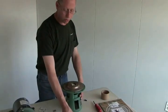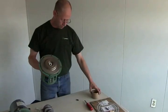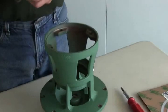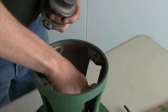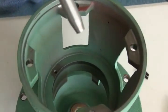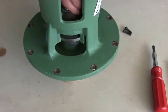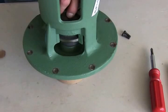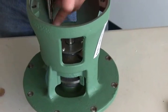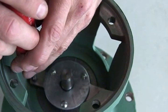Next, take your new cartridge out of the box. Flip this over, take the shaft sleeve off, and slide it into the bracket. Take your cartridge and slide it in. Remember, the holes are offset — if they don't line up, spin it 180 degrees and you're good to go. Take your two screws and tighten them hand tight.